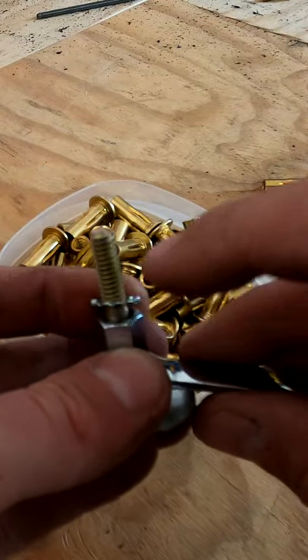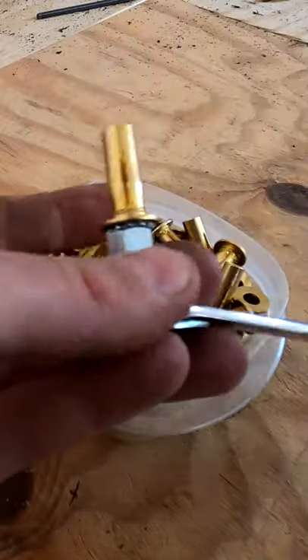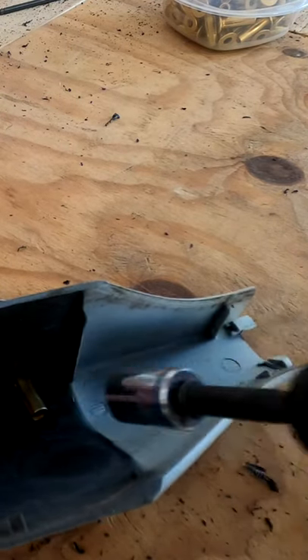Get a wrench that'll fit on your 5/16 coupling. Install your lock washer — you can use a split washer, but I like these star ones just a little bit better. And there you go, there's your assembled tool. Don't over-torque it; you'll rip the bolt and then you'll leave part of the thread stuck in the insert.